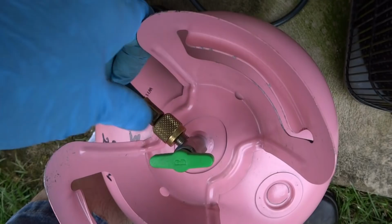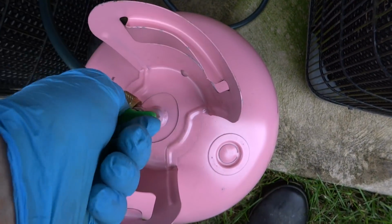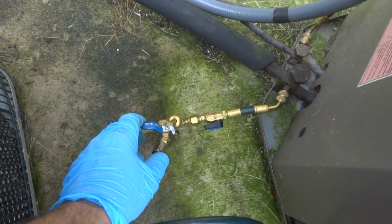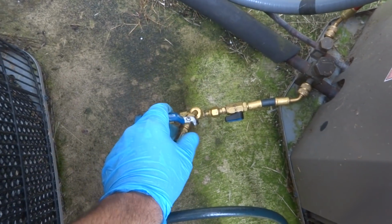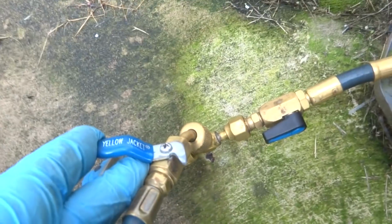Leave it back here, then I'll flip it upside down. I'll turn this on, flip it upside down, then I'll meter it through that little valve there. Put some in through here and give it a little gundy. You want to flash the liquid with the gas, so you don't want to put too much in, just a little bit.